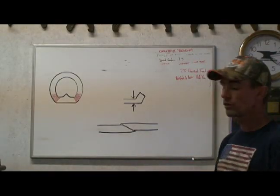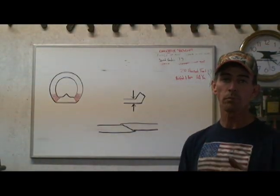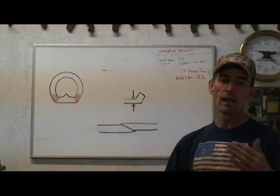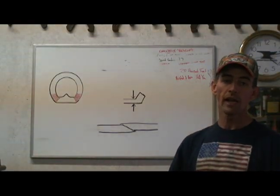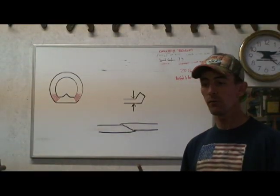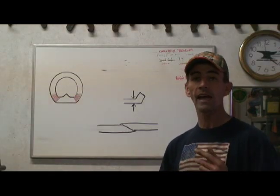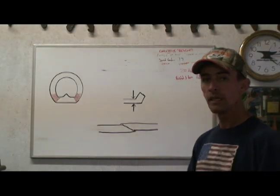When you weld, you can weld any way you want, but the left branch over the right branch if you're right-handed, and the right branch over the left branch if you're left-handed — because you'll always be pulling the weld towards you. If you weld with the wrong branch underneath and you pull your hammer, which you have a tendency to do, you'll pull the weld apart. Whenever you're welding, make sure that you dig with your hammer and not hit flat. All that splatter you see on the floor is the material you wish you had in your weld, so you don't want to squish your weld out everywhere.